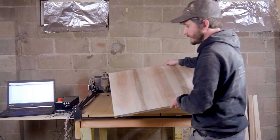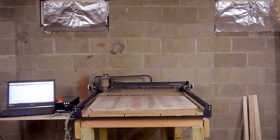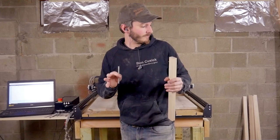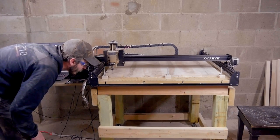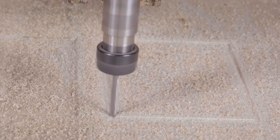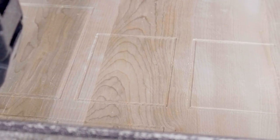When I set the slab on the cutting surface of my X-Carve, I did notice that it was slightly warped, but that's something I should be able to fix by adding bracing later, and in the meantime I can hold it flat against the table with clamps. Once it seemed like my power had stabilized, it was the moment of truth. I marked a zero point on my board and started cutting. The chips that the carving bit threw off from this nice hard maple were a lot larger than the powdery fiberboard I cut my tests on, and so the cuts looked a lot nicer from the start. Once the X-Carve started cutting the pattern on the right-hand side of the board, I did notice that the cuts were shallower, which means I probably sanded that portion of the board thinner than on the other side to correct my gluing errors.